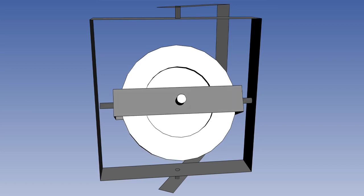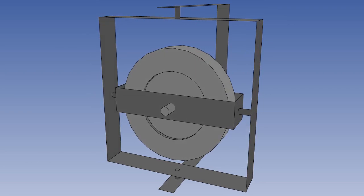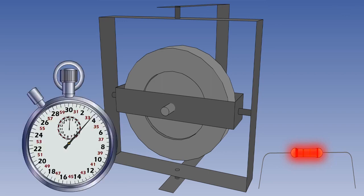The inner gimbal is therefore driven to a position at 90 degrees to the outer gimbal, and the outer gimbal is driven at 90 degrees to the frame. This is called caging. We can now run the motor up. Additionally, to give good stability and accuracy, the gyro needs to be run at a constant operating temperature within a narrow band of limits. Once it is up and running, we need a ventilation system to get rid of the waste heat. However, in order to get the system at temperature quickly, we apply heater voltages initially. This whole process takes about 3 minutes and is fully automatically controlled by the computer. Once it is complete, alignment proceeds to the next stage, which is levelling.